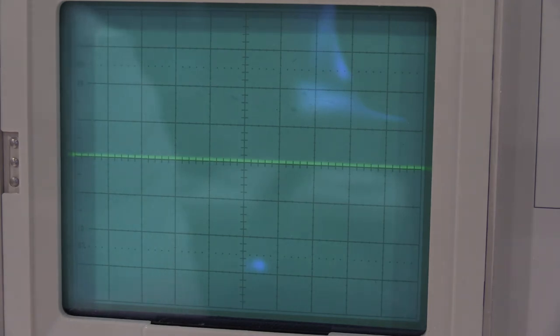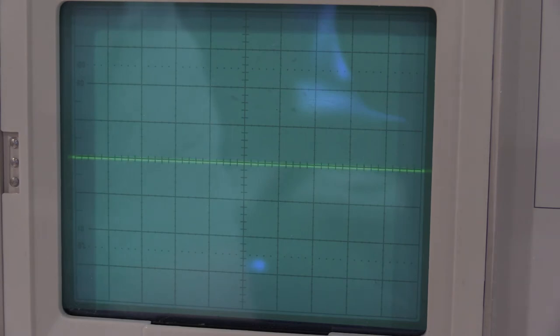R2353. No, I'm sorry. You don't do the same thing here. This one is at 5 millivolts. The trace should not move more than a half a division when I hit the invert switch. It does not. And it does want minimum trace shift, but this one is adjusted for minimum trace shift on invert. We are going to adjust 2353. And there we go. We improved it just a little bit. Now it doesn't even move off the center line. So it was off just slightly. So we kick that back to up.